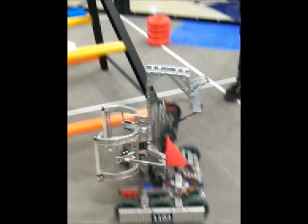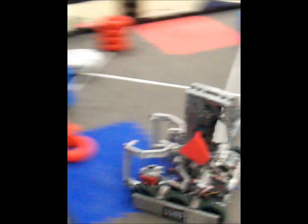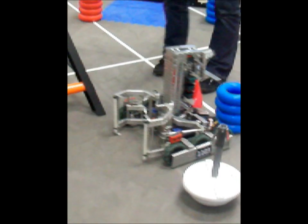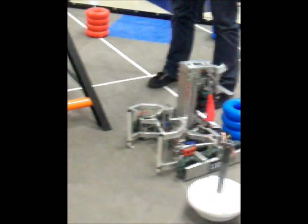The two main applications are the vertical lift and the drivetrain. My drive wheels are running at 160 RPM on four-inch tires, which — given that motors never quite run at their full speed — works out to about 32 inches per second.